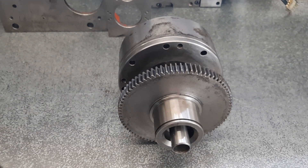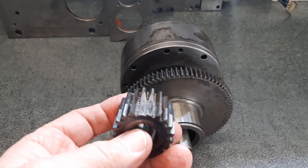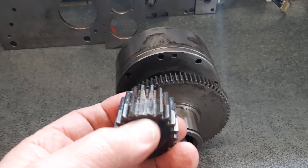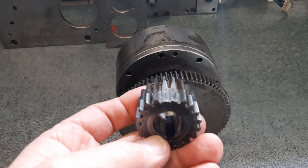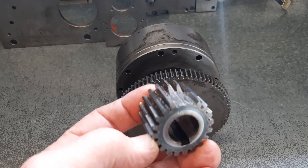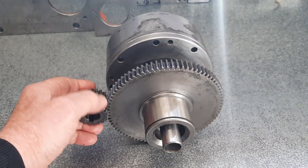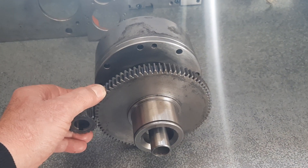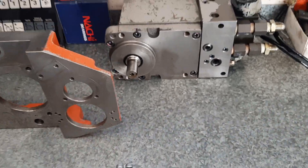To start off I'll just bring in the gear that I've got to cut. This actually mounts on the indexing actuator that I'll show you shortly, which was disassembled in the previous video. As you can see there's a couple of teeth missing out of the side there. It's a 20-tooth gear, and it sits into this larger gear here, which drives the actual turret into position when you're indexing the turret.